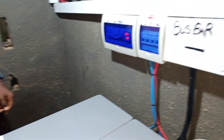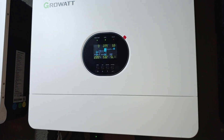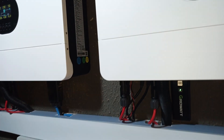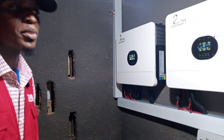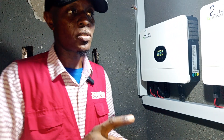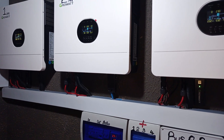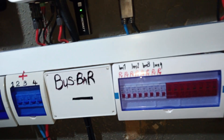Someone will actually ask us: how do you size your cable? On my sizing of cable, I normally check the size of panel you are using and the connection in series. There are many factors we consider — the distance of your panels to where the inverter is, and also the current passing through the cable. In this solution, we used 10mm² cable, not because the system cannot work with less, but because the panels are quite far from the installation and we don't want any voltage drop.